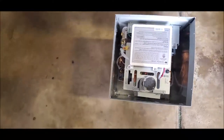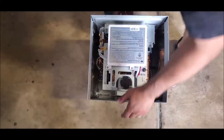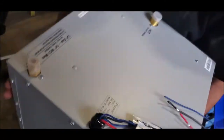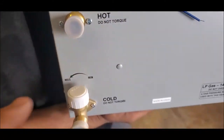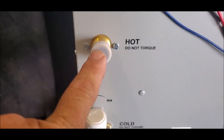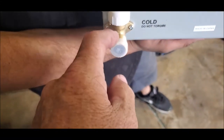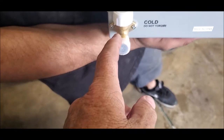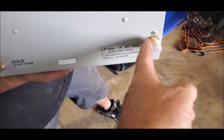The only difference — I'm going to show you — we're going to flip it around to the back side and show you where you get the gas and everything. Basically, you're going to pull the old one out. We're going to put our hot water here, which is the copper line, and we're going to have our cold water going here. This is going out, and then the LP gas goes here. Sorry, I had it backwards.